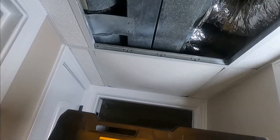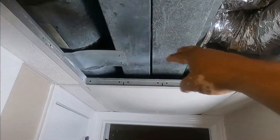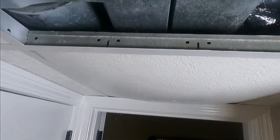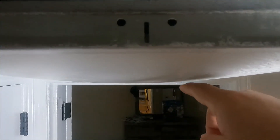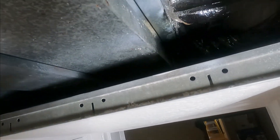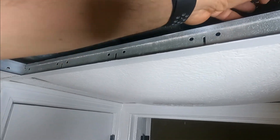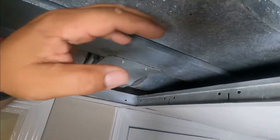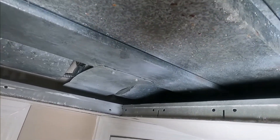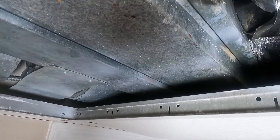So we're here — I removed this ceiling panel and if you see this, it's bulging big time, it's ready to fall and it's leaking as well. Look at this — it's bad. I'm going to check my tray. If it's low on freon the whole evaporator is going to be leaking. I told them to unplug it a couple hours ago so I'll know if it's low on freon once I put my hand in.